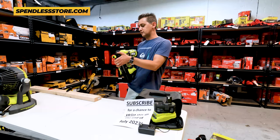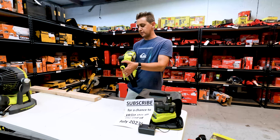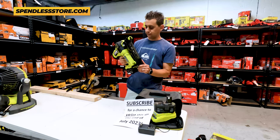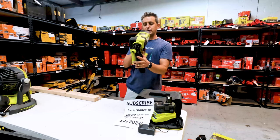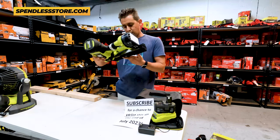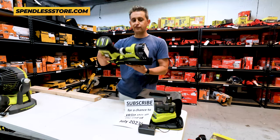Again, that can be adjusted if it's not flush by adjusting this top piece here, and it'll be deeper or not as deep until you get it flush. It does have a button as well to put the light on and turn the tool on right below the trigger here. And that is the 21 degree Ryobi Framing Nailer HP. Model number on this guy is PBL345 Framing Nailer.